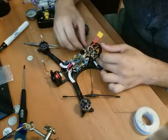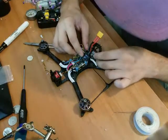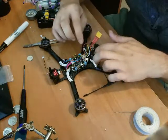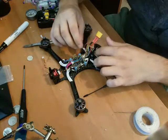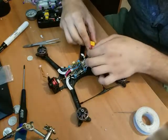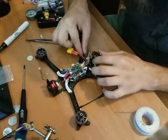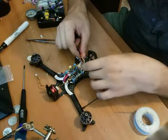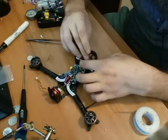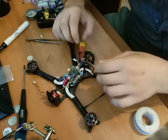And that is what we like to see right there. And then I've got this jumble of wire. I may just shorten that as well. Let's just hold off and plug in the UFL. I'm actually going to zip strap my RX on top of the Pro32HV. And this XT60 lead, I was thinking of running it through this side. So I'm going to pull it through there. Planning ahead when you're building is always good. That's an excessive amount of wire there. Do I want to just jumble that out of the way? I can always just tuck that. It never hurts to have extra wire. Tuck that and hide it right under the capacitor. Look at that, like nobody even knows it's there. Beautiful.